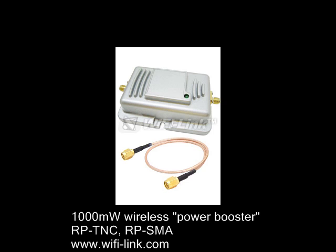You can see that if your power wasn't high enough and you have a large antenna, you might end up being interfered by noise much greater than the signal that you're broadcasting. Getting an amplifier does the most for blocking out other interference — though on the contrary, you might actually be interfering with other people's signals because of how much stronger your signal is compared to theirs. I live in an apartment complex with at least 20 different signals and they've saturated almost every single channel, and for me to get a reliable signal in this environment within two apartments distance is absolutely spectacular.